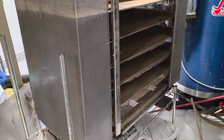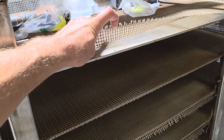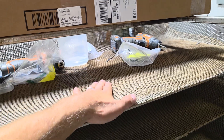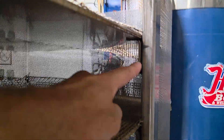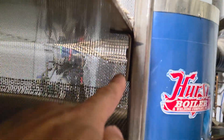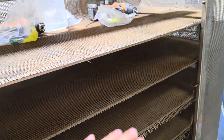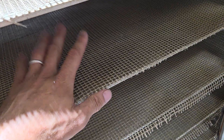A couple of pointers that worked really well for the shelving: the aluminum is set at about a one-degree angle, kind of like that. For height adjustments, these little brackets on unistrut are great so you can totally adjust the height.